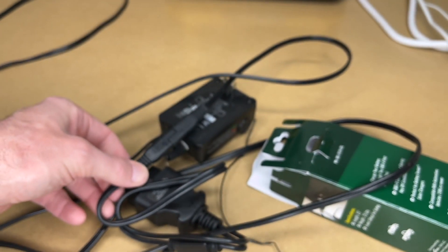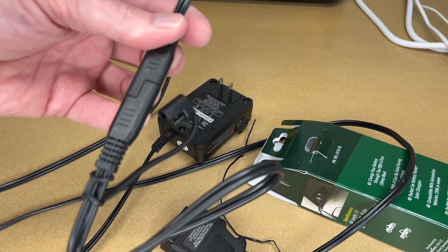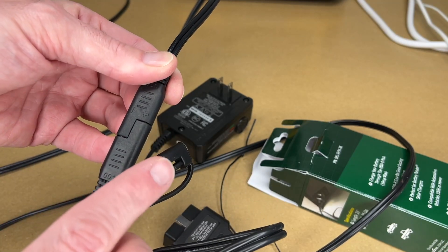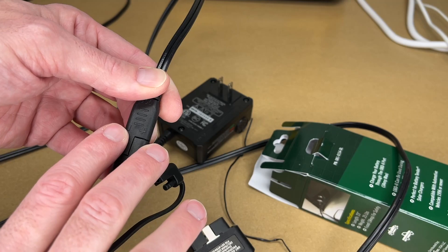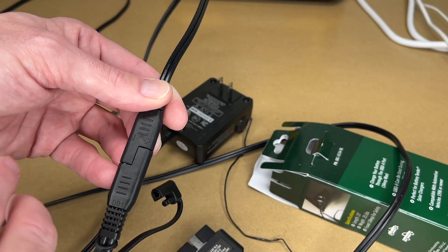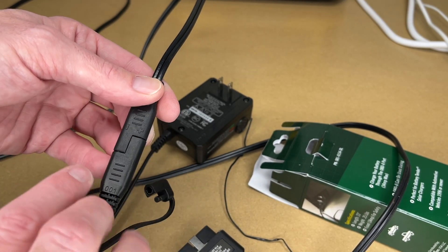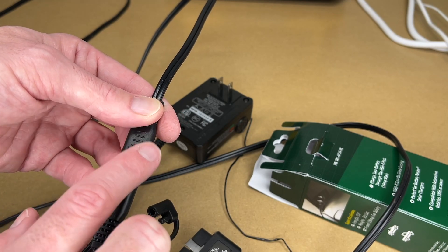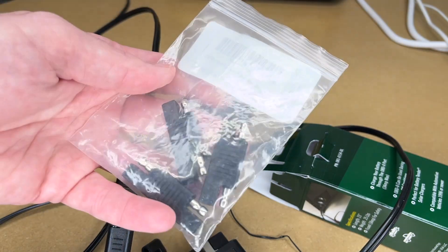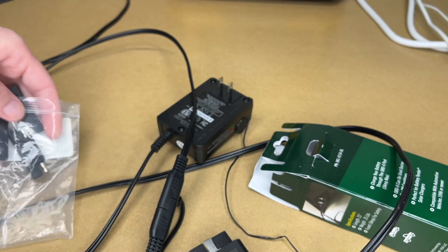With different brands of equipment you may find it has different polarity. The way to check that is to take a multimeter, make sure you have your red and black in the proper ports, and check for DC voltage. If you put it in one way you'll see positive voltage; the other way, negative. You want to see 12-volt positive — whichever side is red is positive, whichever is black is negative. If it doesn't match your adapter, I'll put a link below to polarity adapters.